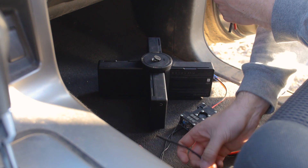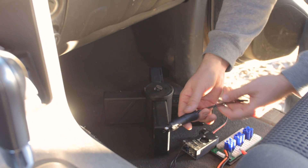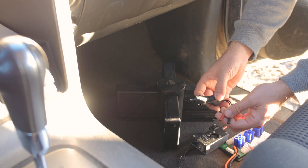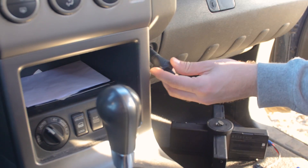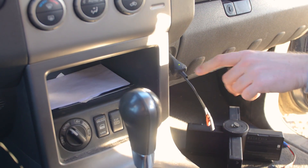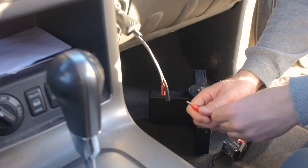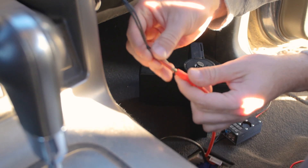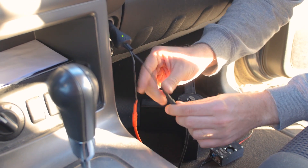With the direct battery cable I can charge my batteries two to three times faster than with the cigarette lighter plug. I added two bullet connectors to the end of the cigarette plug so that I can attach the DC converter more easily. To start charging I just connect the plug to the car's lighter socket and attach the balance board to the other end. I use the board when I want to charge multiple batteries at the same time.